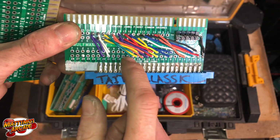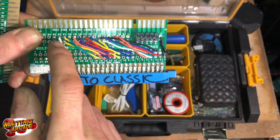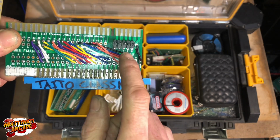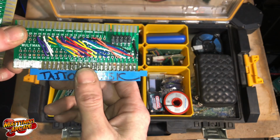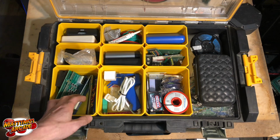These are all the Elevator Action pinouts, and this is Jamma. So you just go to there, to there, to there. And then this one actually has a separate connector for power. So I was able to just put this header pin up here and then run a Molex and a little mini harness over to the other one. Worked perfectly fine. I was happy with that.